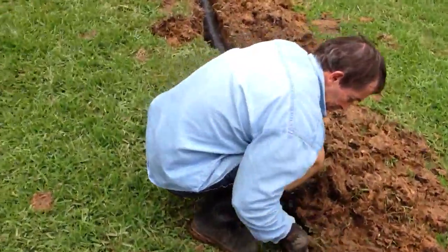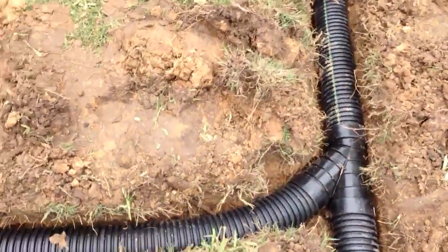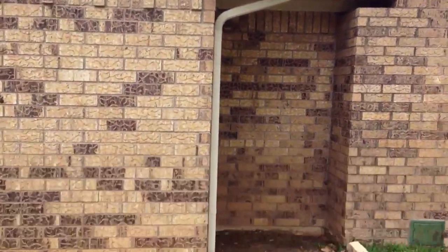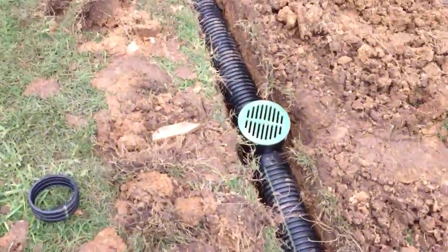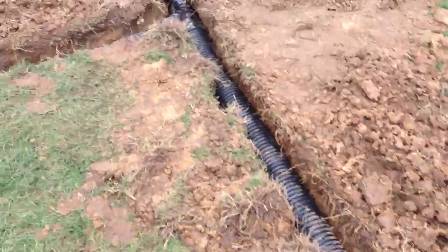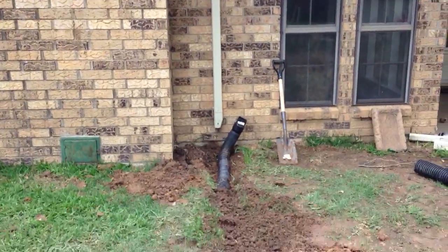come along, meet at the Y connection. That Y connection goes up and connects to the downspout of the house at the edge of the master bedroom. So they've got a connection there which goes into a catch basin. Go a little bit further and you've got another Y connection that heads over to the other downspout to the side of the fireplace.